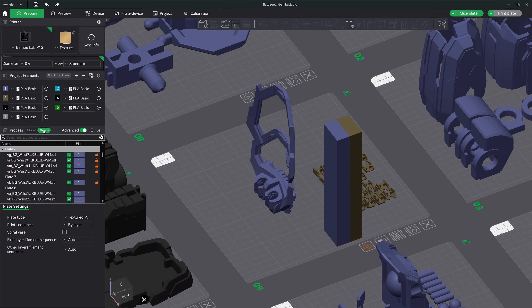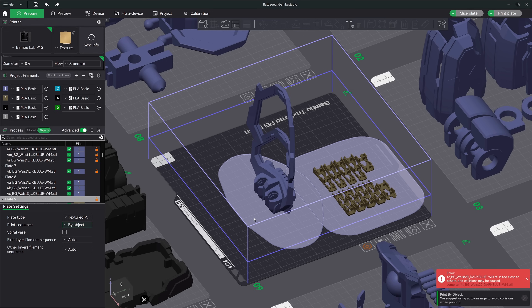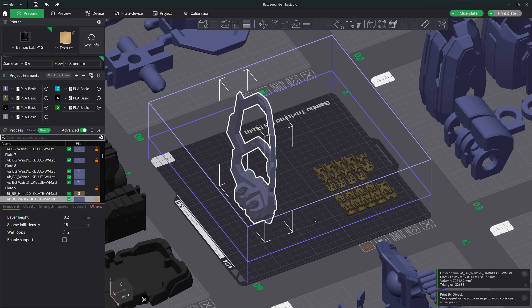With the objects tab still selected, click on the build plate itself and you will see the plate settings appear. If you change the print sequence from by layer to by object, we will now see a bounding box around each model. This box represents the path of the tool head. So what we need to do is move them far enough apart so that the printer won't ever collide with the other model. We'll print these little hinge models in brown first, then switch to the purple color and print the entire model second. Once I move the purple model away we're now ready to print both models one at a time. Again you can simply apply the model settings just as we did in the last exercise — infill density, brim, and so on.